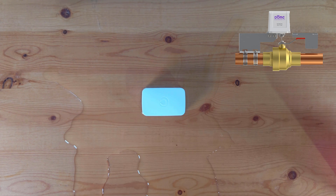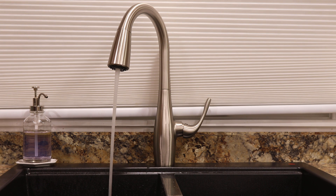The second bonus smart home automation is leak notification and flood prevention. Simply put out leak sensors in common areas that could possibly have a water leak and set up a notification to be sent when they are triggered. Common places for a leak sensor would be under a sink, behind a toilet, under a refrigerator if it has a water line, under a utility sink, near or in a sump pump, near a hot water tank, and under a washer or dishwasher. Being notified of a possible leak as soon as possible helps you prevent further damage. To take things further you could install a smart water valve, which there are several different types of — the smart water valve would then get triggered to shut off if any of the water sensors detect water. If you're interested in more in-depth videos going over how I set up the automations in this video, make sure to check out the playlist linked here.